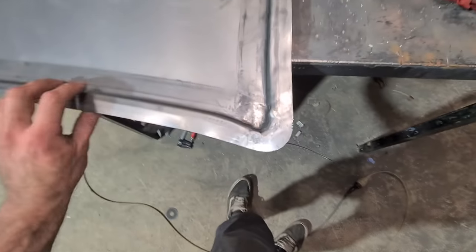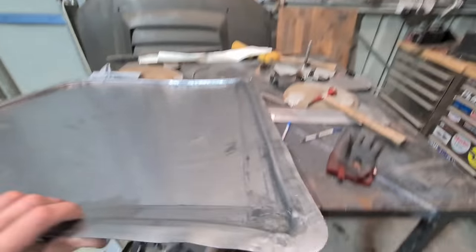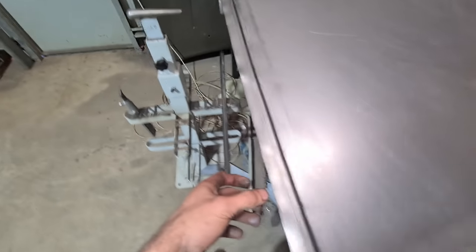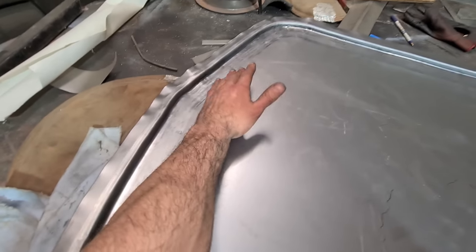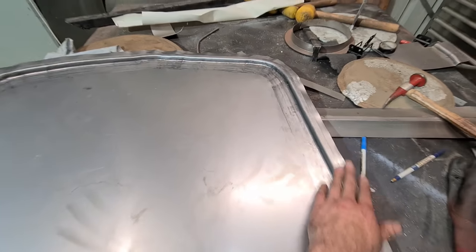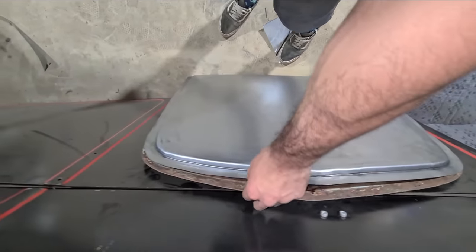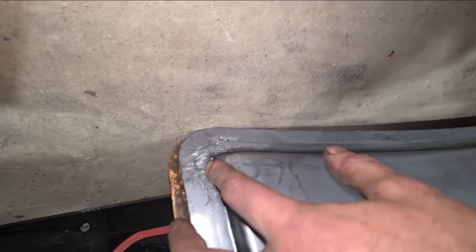I'll address the corners before running it through again and stay away from them for the next pass. I'm at about 80% depth now and it's got to tidy up where it doesn't like going around nicely. I'll tidy that up by hand, trim the edge where it's long, and hopefully get away with one more full-depth pass. I've also got to put the arc in the panel by stretching this edge and running it through the die.